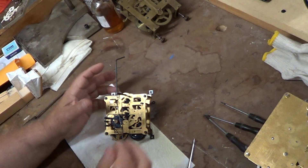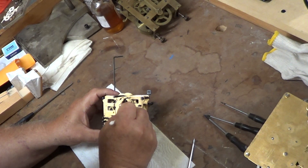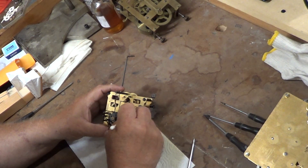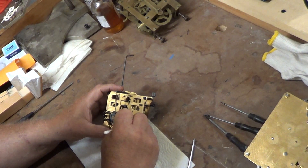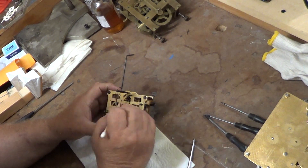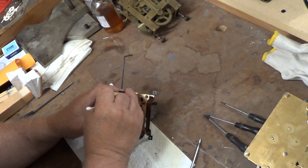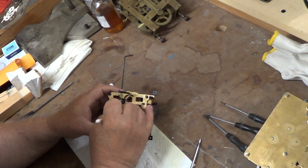Get your Q-tips out and go right in here and clean those — you can see how much dirt is on that. You have to get that out of there. This is the only way you can tell whether your cuckoo clock is going to be usable or not. These use heavy weights and have very thin brass plates, so they wear out pretty easy if you don't keep them oiled. Most people don't — they run the clock for 10 or 15 years, then wind it up one day and wonder why it doesn't work anymore. Usually it's a bad gear or a pivot that's worn out.